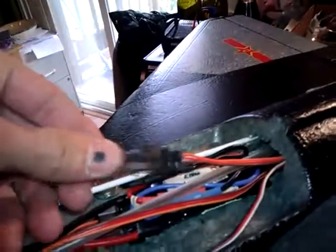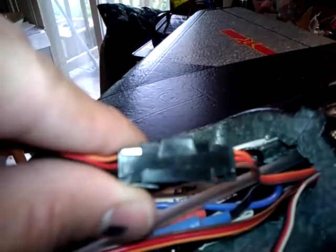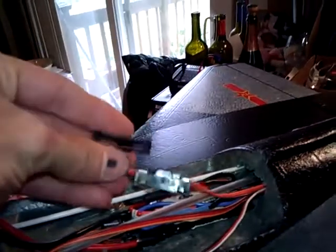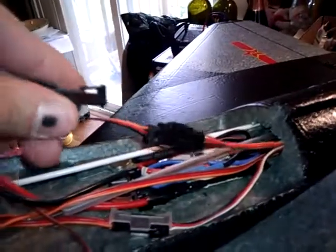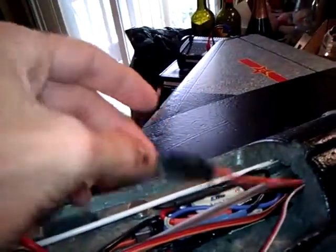Last thing, guys — after I got this all hooked up, I had to run all my wire through that small hole there, which required a little bit of modifying. I just wanted to remind you guys: whenever you are putting servo extensions on or Y connectors, these little guys right here — you really want to check into these. Very cheap and can save your butt. I found one of my connections inside the plane, when I took it apart to do the thrust vector, that was actually pulled out a little bit — it was my elevator from my Delta. That could have been very bad. So I went through the whole plane and put these on — just little safety latches, like a dime or a quarter at your hobby shop. Put those on all my connections and it makes it so you cannot pull that apart. I really recommend those.